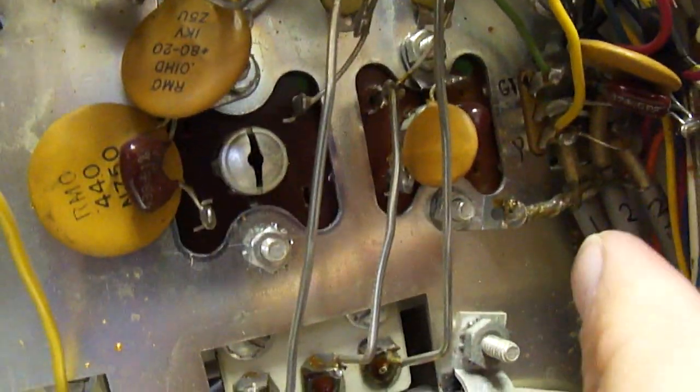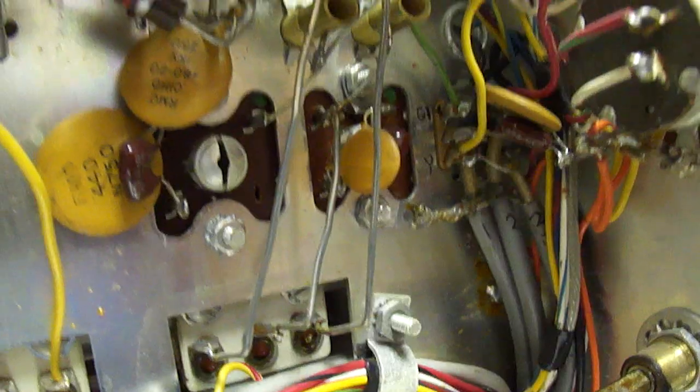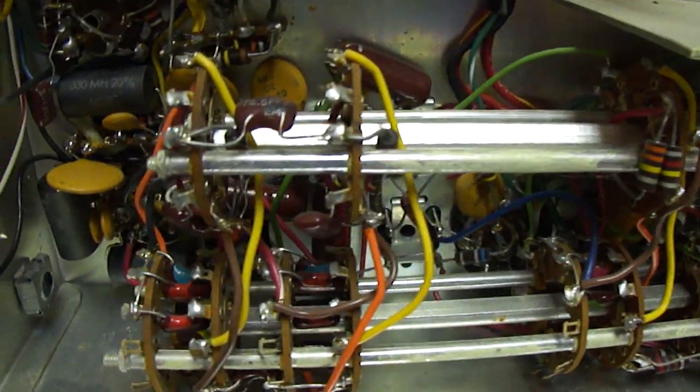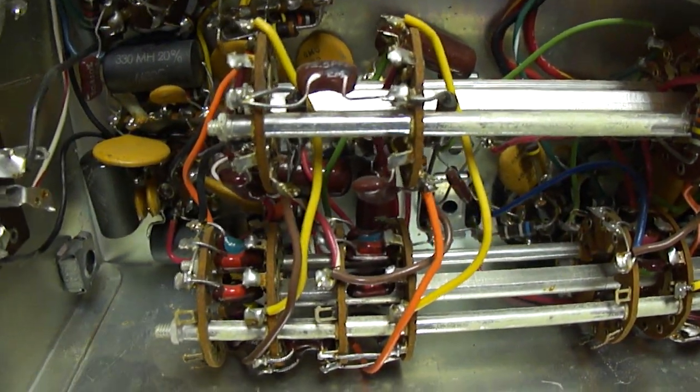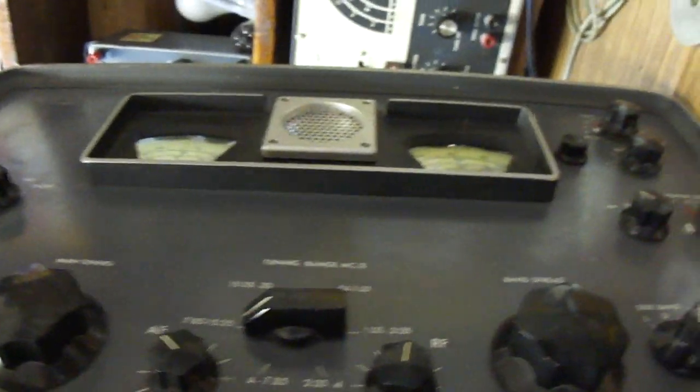As far as I can tell this is from 1966. So what I'm going to start with — I think this is the first IF, right back in here. I've started labeling stuff to try and take this apart; this is going to be complex. This is probably the most complex job I've done like this where there's bad IF capacitors. I'd really hoped that just some new electrolytics would get it going, but with those cans it just didn't quite do it.